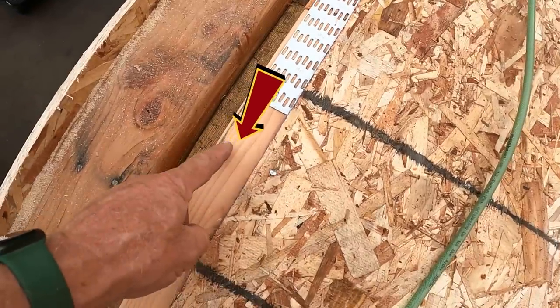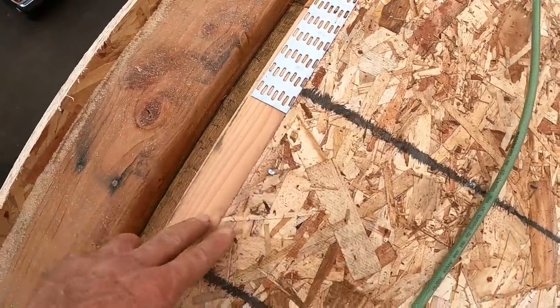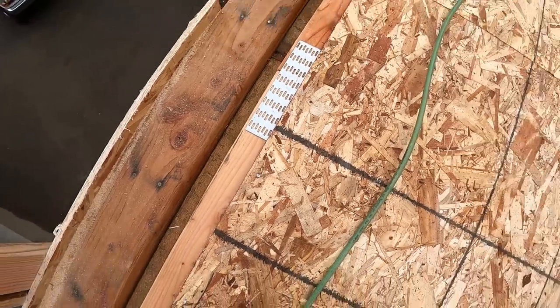Because the last thing I want is to raise that gable end truss all sheeted up and find out that these two pieces of plywood are interfering with each other and keeping the truss up off of the crown plate. Shipwreck. Have to lay it down. That's dangerous. So a 3/8 of an inch gap all the way along the front of this thing does nothing negative because it's tied together by both sides nailing to the bottom chord of that truss right there. So we'll put a good nailing pattern right along there and tie everything together.